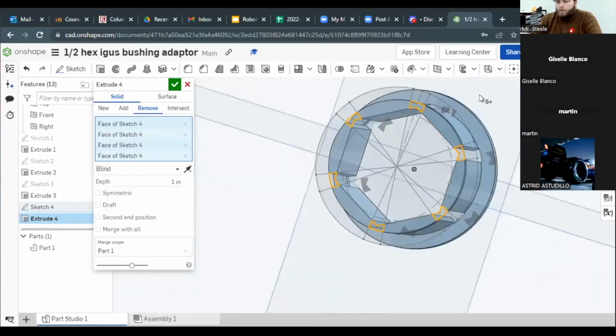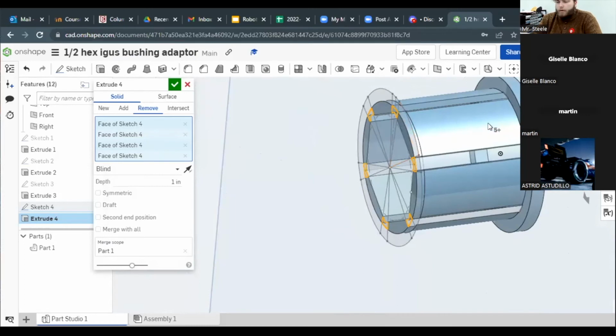Okay. So to determine the distance from the top of the part to the top of extrude 2, we are going to be using two different units of measurement, because if you remember, extrude 3 was in millimeters and extrude 1 was in inches. We extruded 0.51 inch and 1 millimeter. So we're going to change this to 1 mm plus 0.51 in. Enter. And it automatically does the conversions and understands what distance that is. So 1 millimeter plus 0.51 inches is the exact distance we need. We don't need to interpret that at all. We make it do the math.